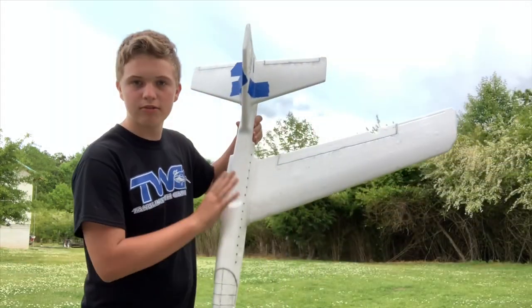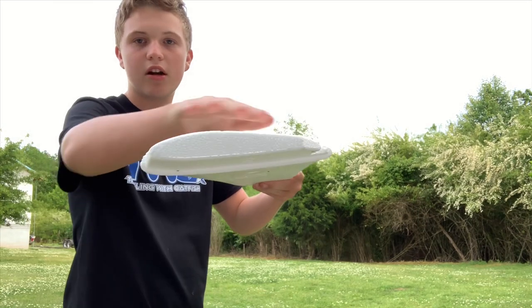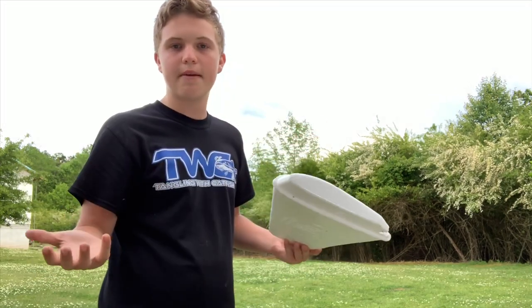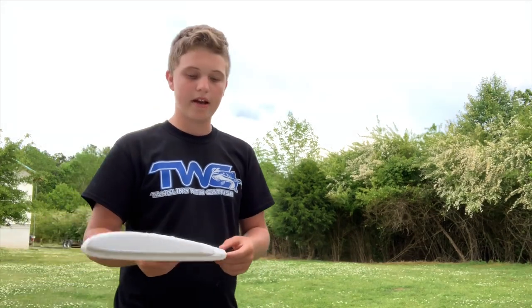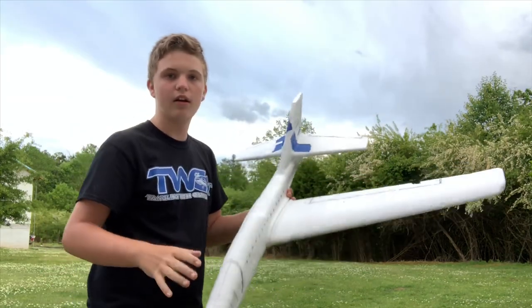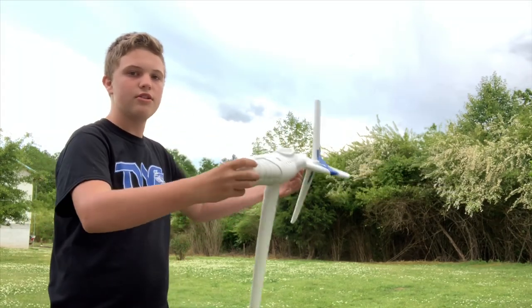Then the wings — the most important part. They have a specific configuration called an airfoil: curved on top, flat on the bottom. The higher the camber, or the higher the arch on top, the more lift will be produced. If you have a super heavy plane you'll want a lot of lift. The wings also keep it from rolling, and the ailerons give you roll control — pitch one up and the other one down and it makes more lift on one side, less on the other, so you can bank and turn.